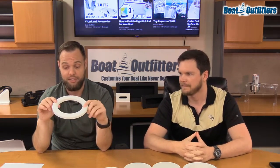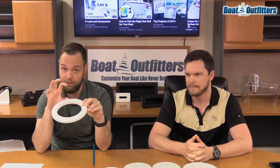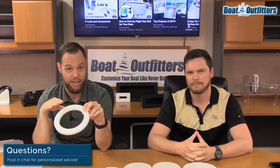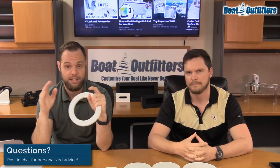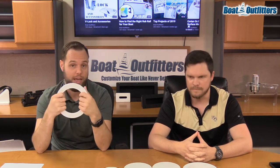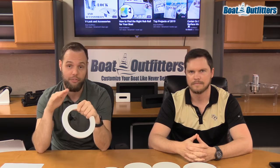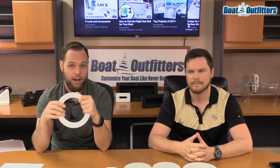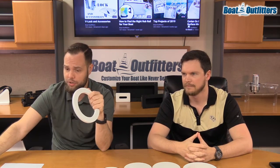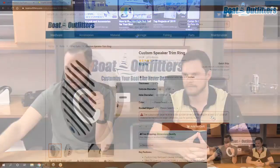And there are limits, of course, based off the thickness, because you do need to leave a 1/4 inch on the thin side. So typically, assuming you're using 1/2 inch, which is our standard material, you're only pitching that 3/4 of an inch, and the size affects how much that angle is. But we do that all day long. So give us a call if you have a project that you need that for, and we can help you figure out just how big that angle would be, and if that would make sense for your application. For sure. So let's switch back over and check out how we sell these parts.